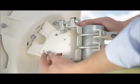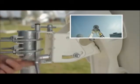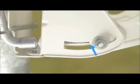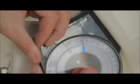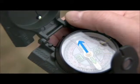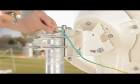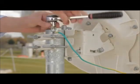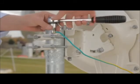Check the elevation locking nuts are loose. Check that your elevation is correct with the inclinometer. In this case, it is 33.6 degrees. Check your azimuth angle with a compass. Fix the earthing cable to the mast clamp. Remember to score the paint to ensure a good connection.